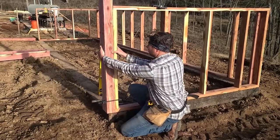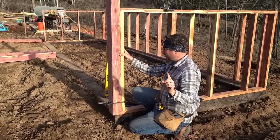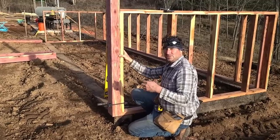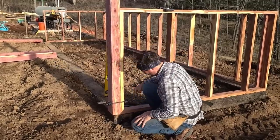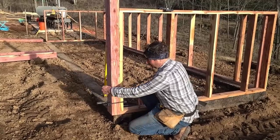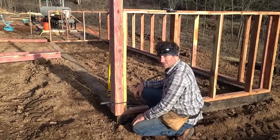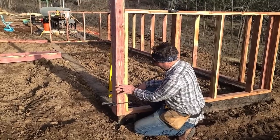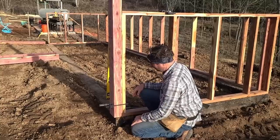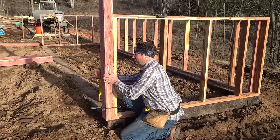Did you put a nail in there? Oh, you were tightening it. Okay. We're gonna come back around. We might need to get lag screws. Some galvanized ones. We'll put them in the bottom plate, and we might even want to do some lag bolts from here through, and thread it through this side, squeezing them together. Unless we have some lag bolts about that big, we could screw them in from the inside of the wall.